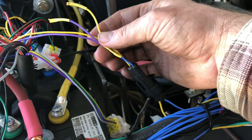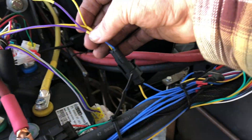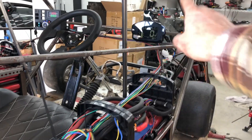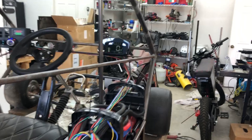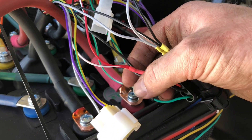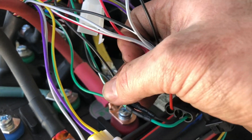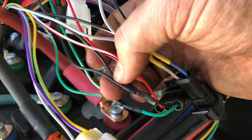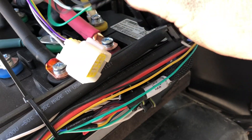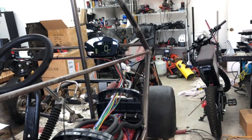For the CAN sensors, I snipped it off because I realized I should only connect it to one controller — I shouldn't confuse the signals by connecting it to both. So one controller gives the RPM signal, though I may have issues with that; some functionality is limited in the app version and I haven't plugged it into a computer yet to diagnose it. For the throttle, I wanted one throttle to control both controllers, so I wired it to both: green for signal, red for the 5V positive from the controller, and black for ground. Colors match pretty well on this one, running through a 3-pin connector up to the front.